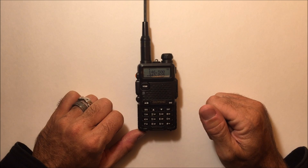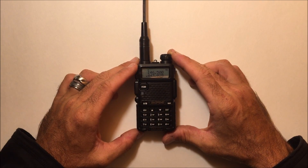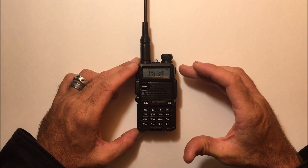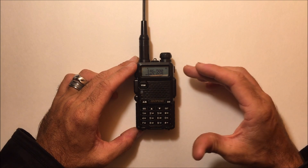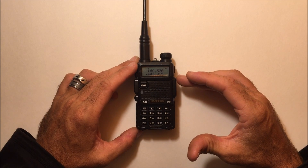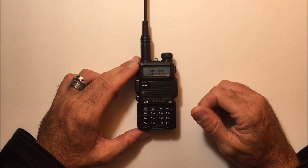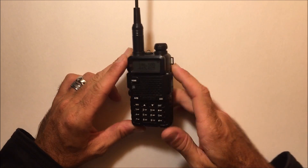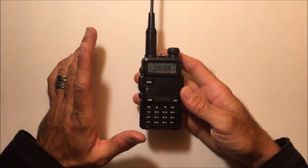People ask, why go digital? Well, digital in something like this will actually encode and decode your voice into a digitized packet form, so that in a fringe area or an area where you have a lot of static, the message is pretty much crystal clear — no hash or static as you would have on analog. The bad thing is, when you're on digital at an extended range, when you could deal with some static on analog, digital drops off completely.